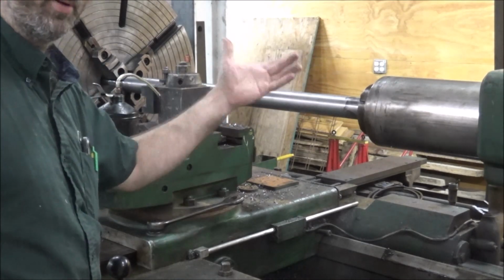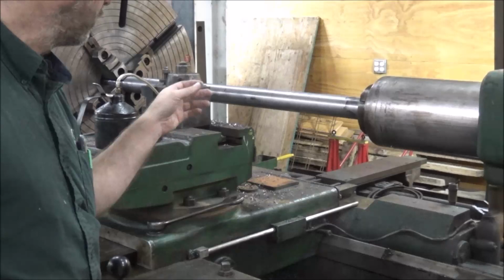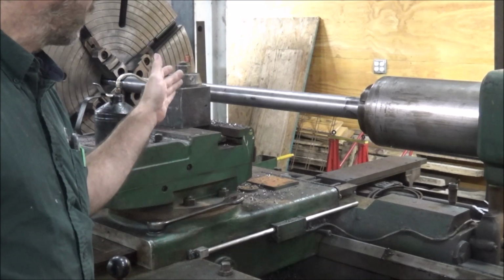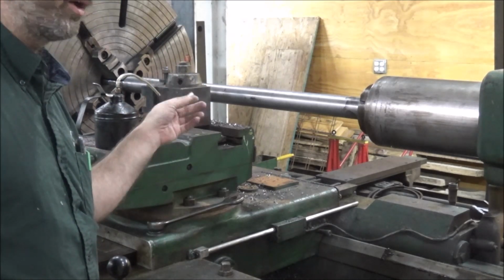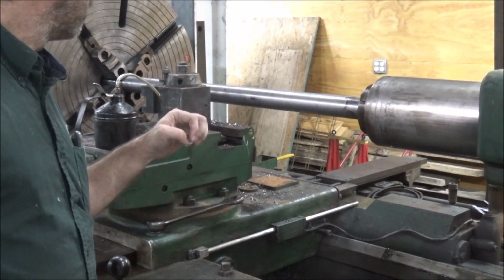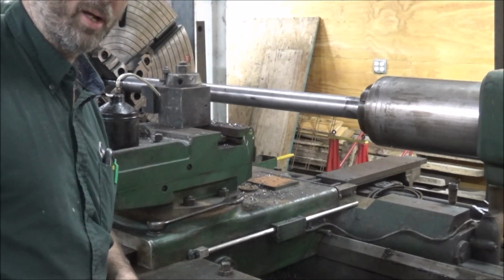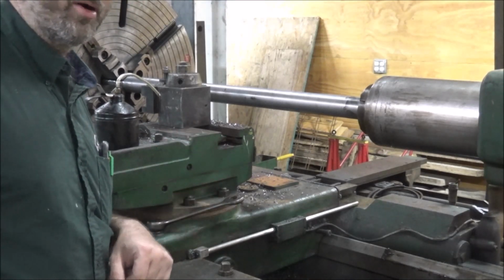This being pipe, this long length, it's got a lot of vibration and resonance. It's not good. Had I started with a shorter length and not got it started chattered, I probably could have done all right, but since I started with a long length, it got chatter in it. It's hard to get chatter back out of it. It takes a lot of turning to get that back to that point, and we're not going to go that far because there won't be anything left of this pipe by the time that happens, probably. So, let's fire the phase converter and give it a go.